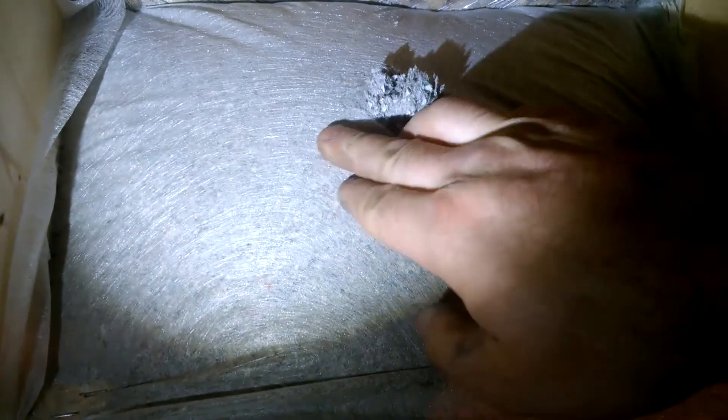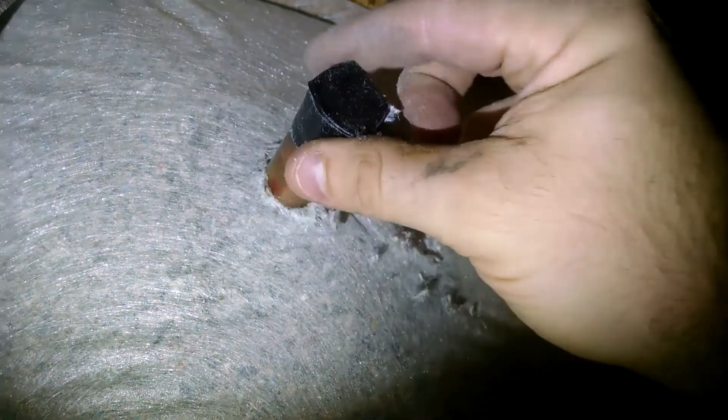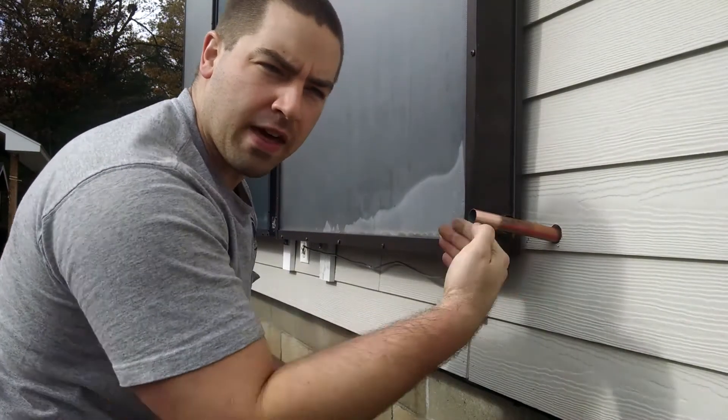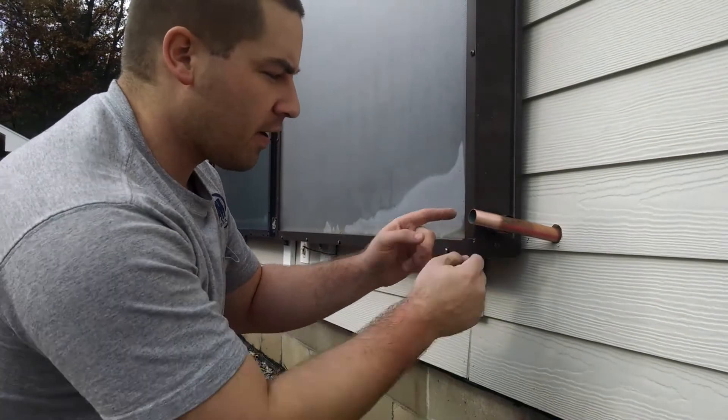I'm inside the tank in the crawl space, and it should be in this joist bay because this is four feet over from where the other one was. I can feel it just at the tip of my finger — I think I'm actually pushing it in farther, pushing some of the cellulose out of the way. There we go, there's the end of the pipe. This pipe is all the way through that rim joist, which is packed about 14 inches deep at this location. Now I have to join the two together.